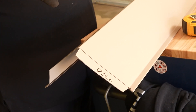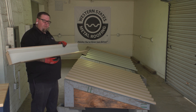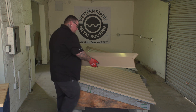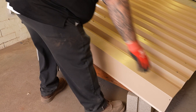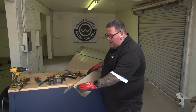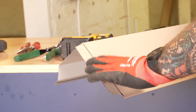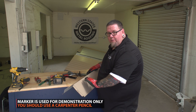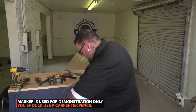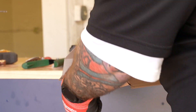I don't want to undersize it because it'll be wrapped around and won't fit as snug. Now that I've got my piece and cut my layout, I want to test fit it to make sure it's going to be a nice snug fit with no gaps or issues when I start putting all these pieces of metal on each other. Make sure it's flush up against the end. After finishing all the layout and test fitting — it came out perfect, by the way — the PVC film is still on it and I'm using a Sharpie so you can see the marks. I'll remove the film for final installation. Now I'm going to take my flats and bend the tab all the way around, nice and clean.